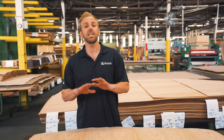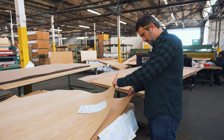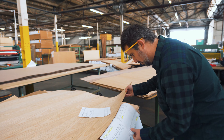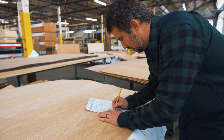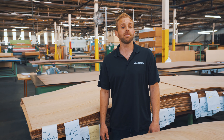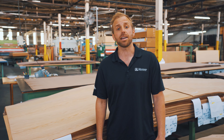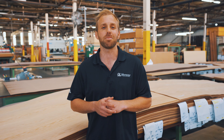This is an important step for us because it helps us reduce the chance of having to remake a face and laminate it twice. We're watching every step of the way and making sure the veneer face is perfectly manicured. It is also our last chance to make sure we have all of our sheets in sequence if they are part of a blueprint match or architectural elevation. Thanks for watching, and stay tuned to the next video where we'll be educating you on the press, where we use massive pressure and heat to laminate the veneer face to the substrate.